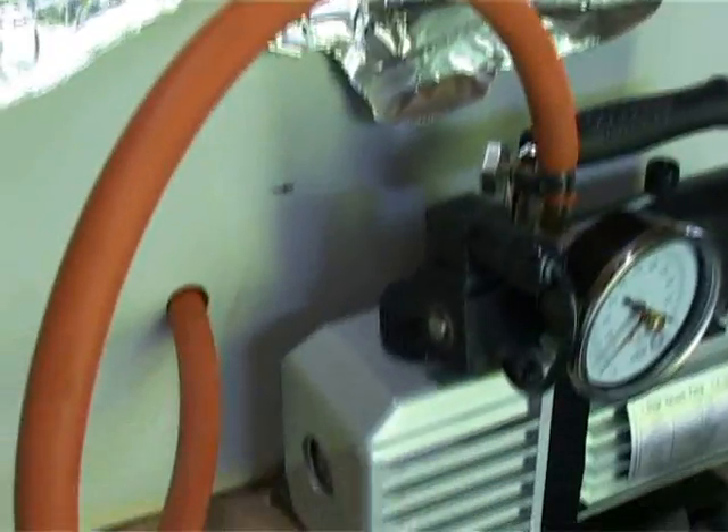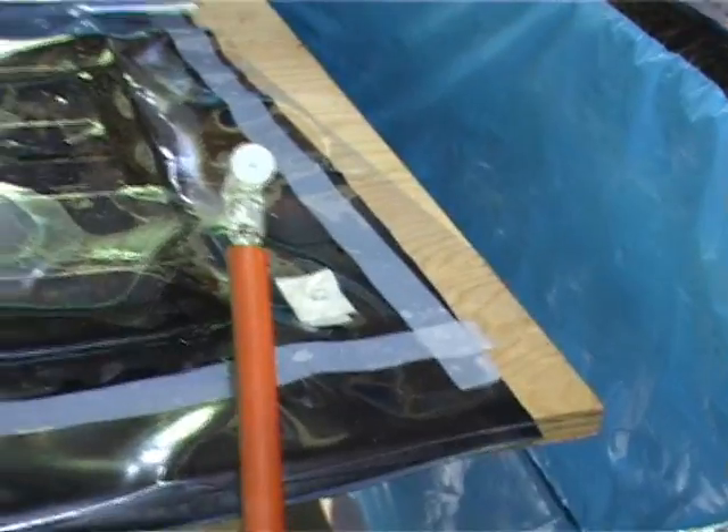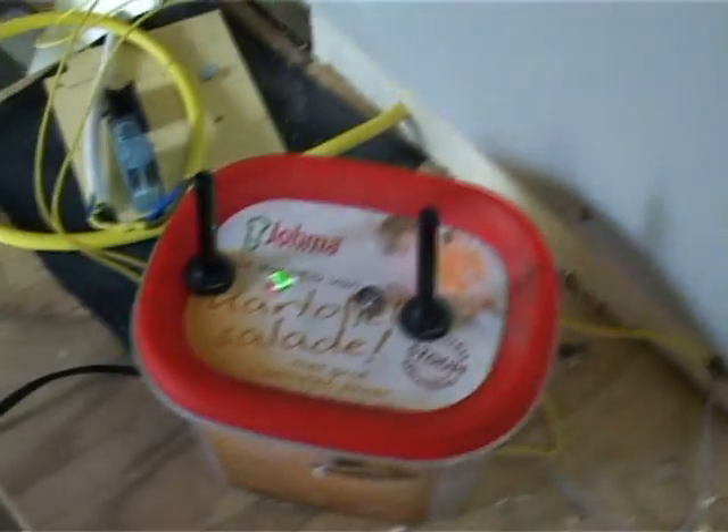This is the vacuum pump — you really need it in order to get low enough pressure to get the bubbles out of the gel. You can also use it with a vacuum bag; here is my setup for a vacuum bag where you can see clearly through it because the top side is PVC. This bag can be used to laminate using a flexible top.